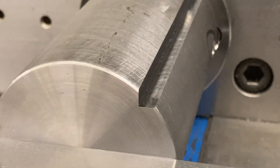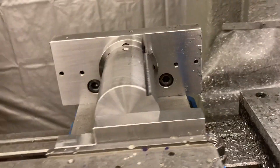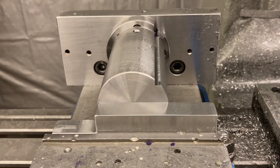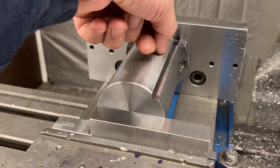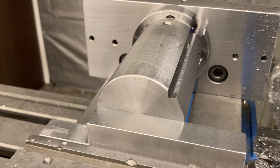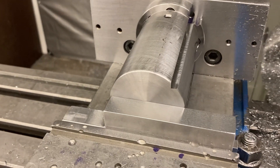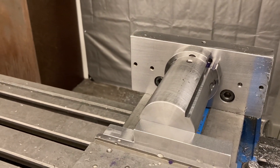You sweep the part to find your X zero, and your Y - which isn't that critical because I'm not holding tight tolerances in Y right now. You edge-find the back because that's where the datum is. But where is this line out in space? You have to figure out what that is. I'm no math genius - I actually barely passed geometry in high school. I probably should have paid more attention knowing I was going to do machine shop work, but it was first period. I am no math wizard, so figuring that out by hand wasn't going to happen. This is what I did instead.